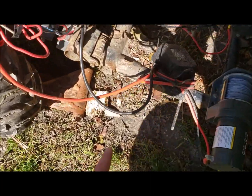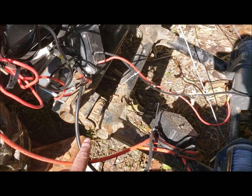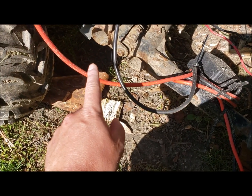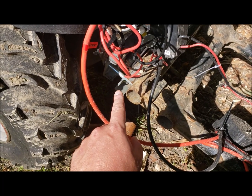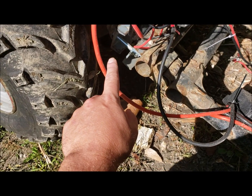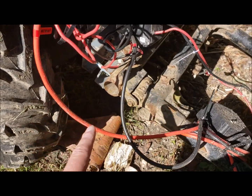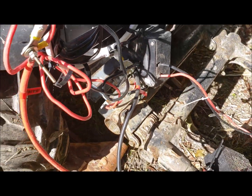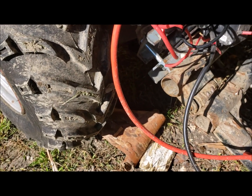This is, my understanding, an old golf cart frame, and they already had these two hinges here and there, so I just welded that to C-channel, I guess is what you call it. I don't know what it's really called. I guess if it's an I-beam, if it's together, then separate, that's like C. And then I welded another one inside my frame up in here, and then I got like 1/2-inch bolts that attach the two things together.